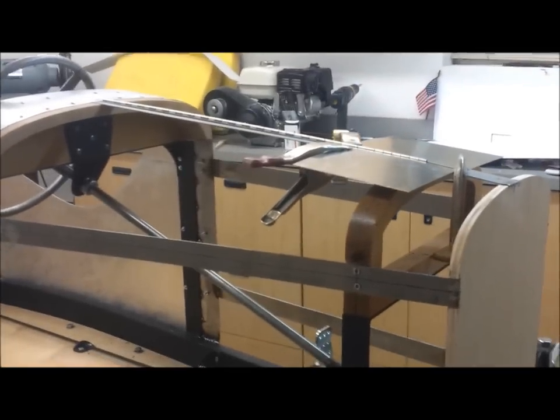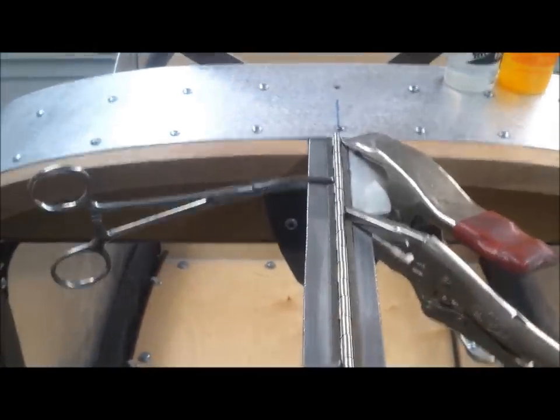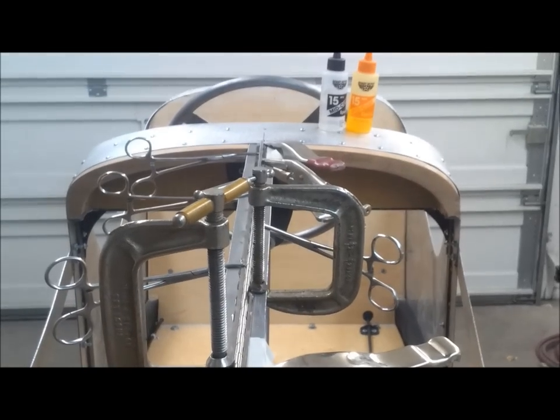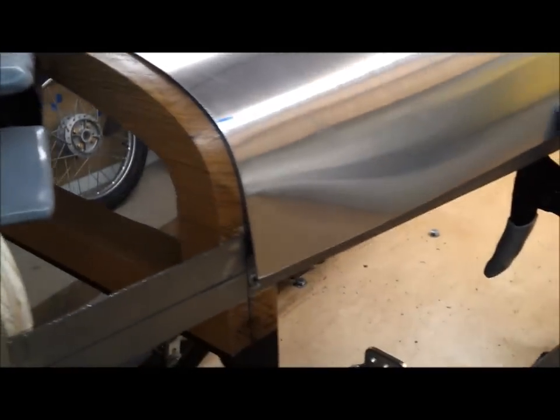If I get the hood on — which won't be all that easy — and then get the radiator on, that'll be another tough piece, but the side pieces will be a cakewalk. I decided to use epoxy, a two-part 15-minute mix, to glue this hinge down. It just has to hold it in place long enough for the metal aluminum to come up around and capture it. This is the pattern I used to make the hood panels — I very carefully laid it on, clamped it down, worked the edge, and got a nice edge I could transfer to a piece of aluminum with a sharpie marker.